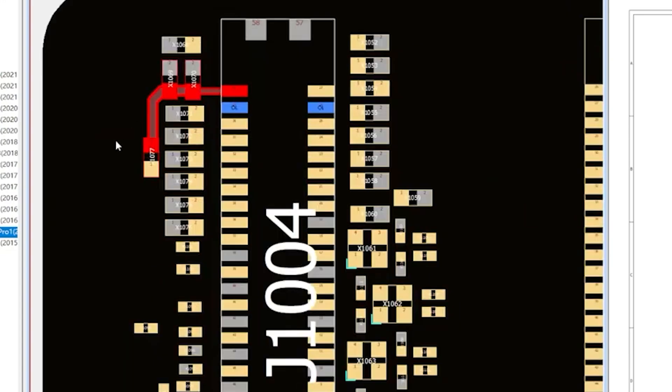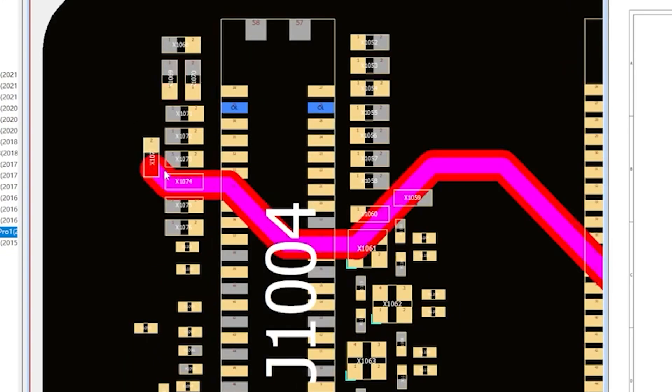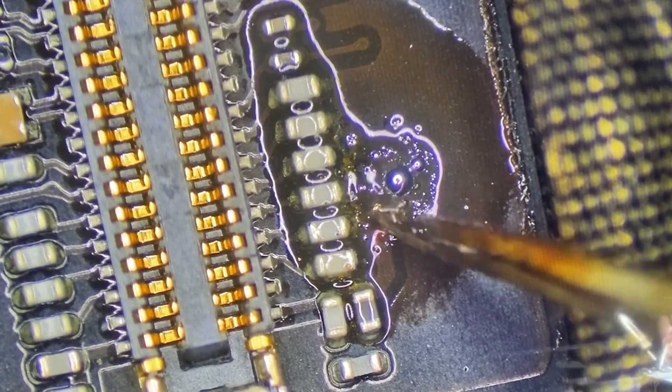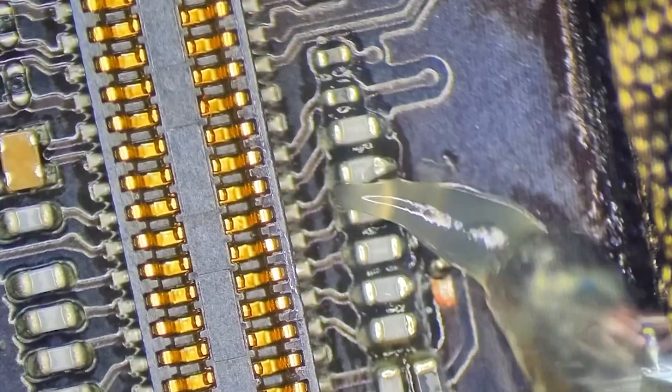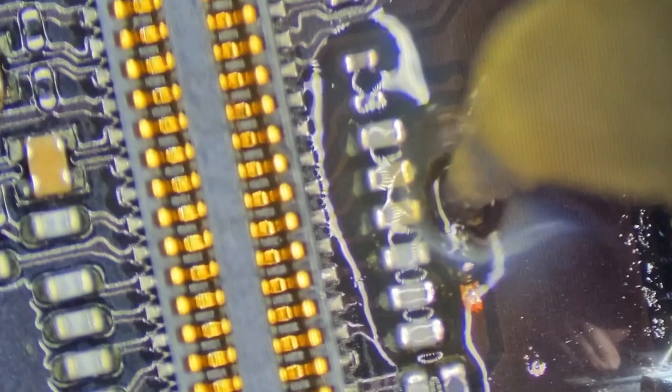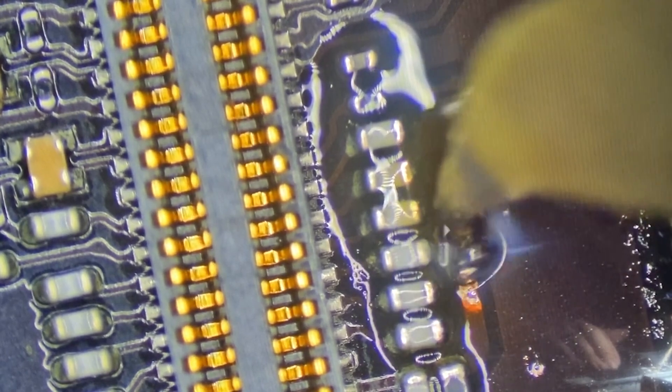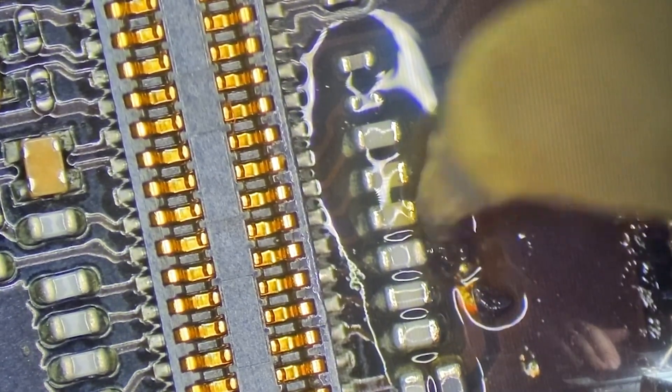So I have to carefully approach it with my soldering iron, adding some lower-melt solder — I've got some 138 here — that I'm going to add to the pads on both sides to help loosen it up. I'm going to work the iron around for a couple of minutes to really try to get enough solder onto these pads that I can somewhat break up and hopefully pick away the component, because it's not going to come off like a typical component would.